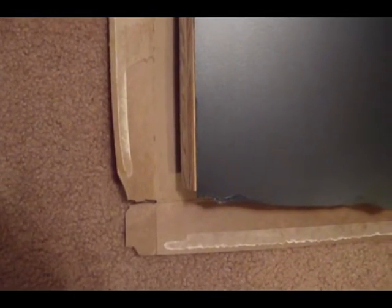It's kind of hard to tell in the video, I guess, but I don't think that wood's completely true where that's cut. I don't think it's a completely straight edge there, but it looks pretty good. And once we cut these other edges out with the router, they will look perfect, and when it goes in the cab, it's going to look nice. And we'll come back after we do that with the trim router tomorrow, and we'll flip this piece over, and where the holes are for our little speakers, we'll make some small holes with some very small drill bits, and make maybe 8 to 10 holes or so in there for the sound to come through.